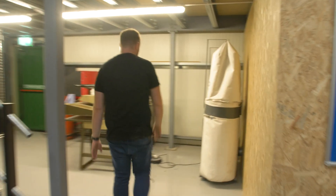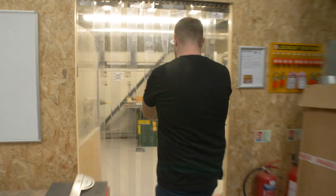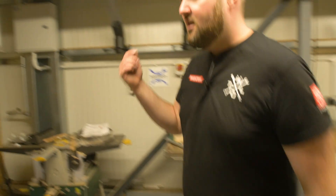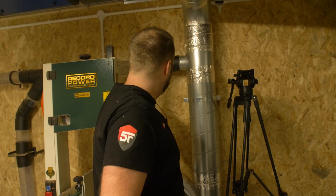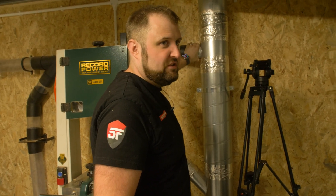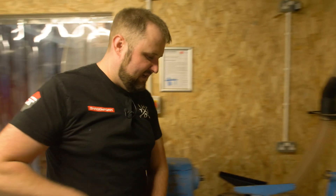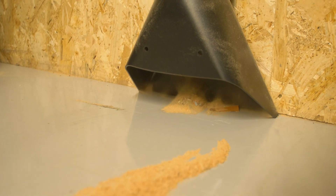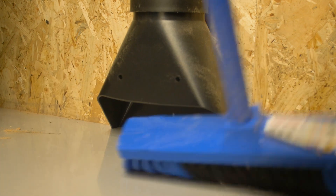The main system is done — so this is the most exciting bit: we can turn it on. The extractor has been in place since the start but we've not turned it on yet. It's running from an extension lead for now. That is a great sound. So that's pulling out here, and inside we can hear there's nothing — no major leaks, just a little whisper. We can always go around with a bit of duct tape later to get any little whistles, but overall that's really good. The final test: I open the blast gate on the leg dropping to the floor — you can hear the difference and it takes everything away. That is the dream right there. That is so satisfying.